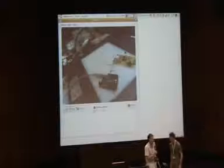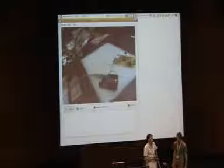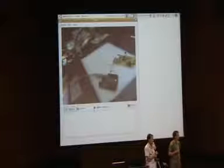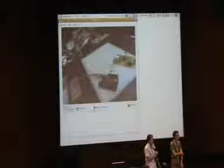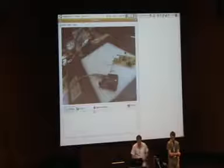A continuous current flow. Yeah, we get a voltage divider, right? Yes, you get a voltage divider effect. The DIO needs to have an optional 47k pull-up resistor, which should be enough so you can short to ground and get a decent signal out of the push button switch. Yeah. Okay, cool.